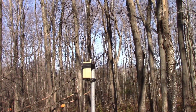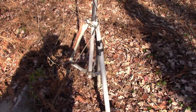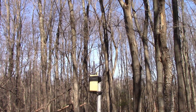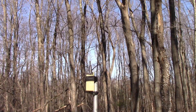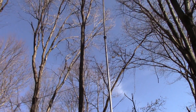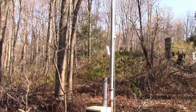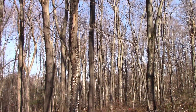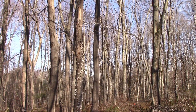You guys might have seen this in the background sitting on a tripod held down by concrete blocks. This is an active antenna — it uses a pair of MPF-102s in parallel and about a three-foot whip. So I have a choice between that, the large 16-foot loop that was there before, this vertical, or about a 50- to 60-foot-on-a-side three-turn loop. It's kind of like an antenna boneyard out here.